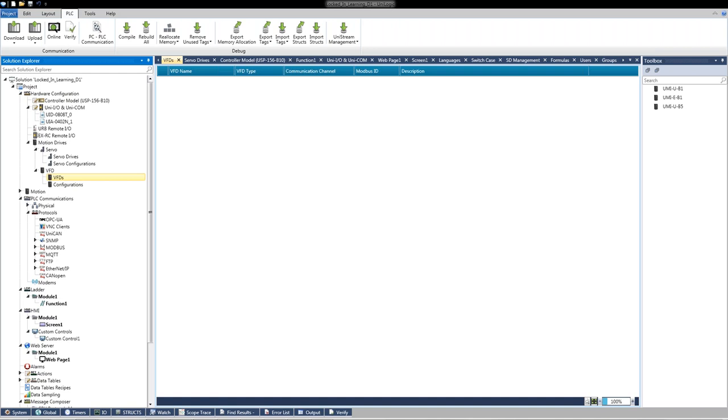We have communication modules for other PLC brands. We have communication modules to add serial, Ethernet, CAN bus, all different ports. If the other device shares one of those ports, then yes, we would be adding a port to talk to that other brand, but no port that is unique to a particular brand.